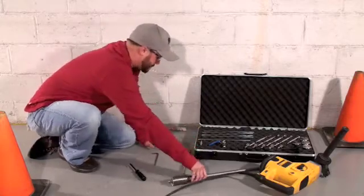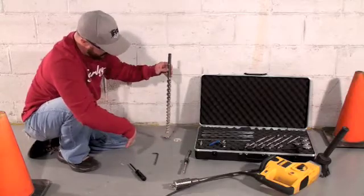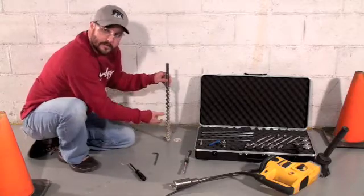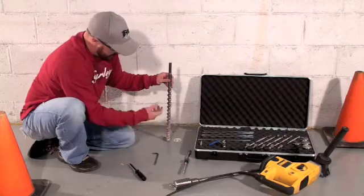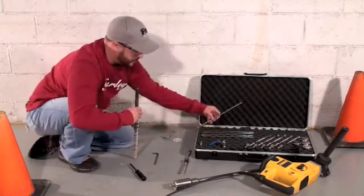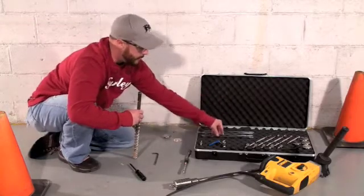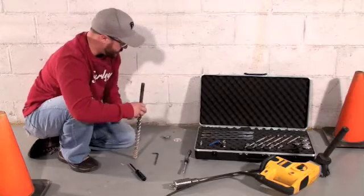You'll replace this one with the one-inch masonry bit. This bit is used to completely penetrate the slab. Every slab is different and depths vary, so you might have to cut your quarter-inch stainless steel tubing on your implant accordingly — measure your hole first.